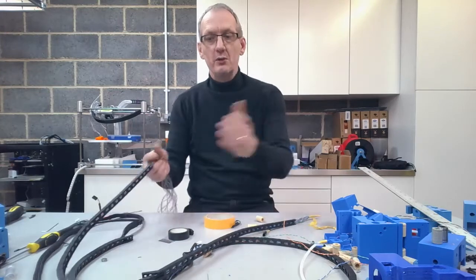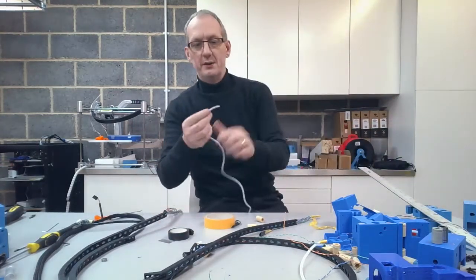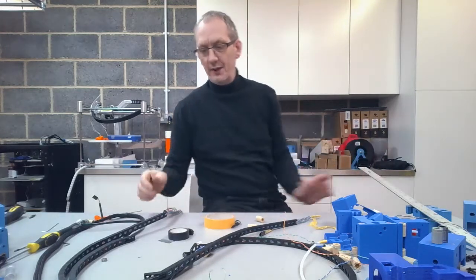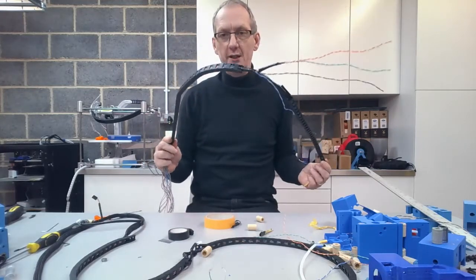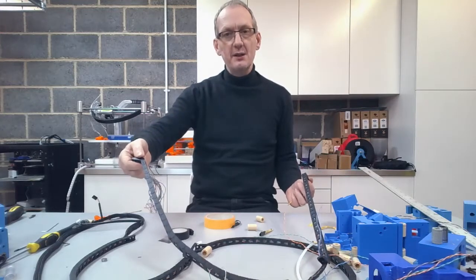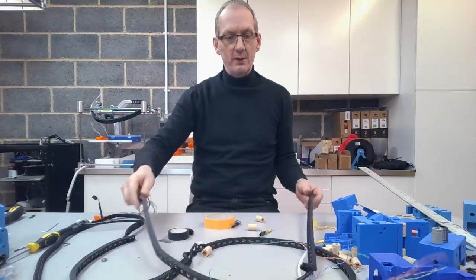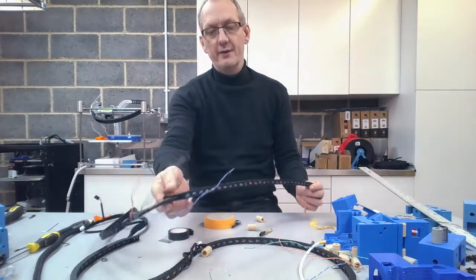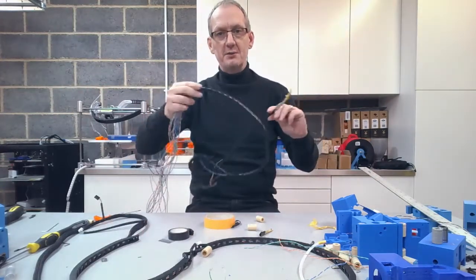And what you do is you cut the outer sheathing off. I'll show you on here. Piece I've got. So you want to be cutting the outer sheathing off and then putting it through the 2 pieces of energy chain. One of them's got 29 links on with the end. The internal measurements of this are 7mm by 7mm, and the other one has got 30 links on with the end. And that's what we need to do to get to that stage.